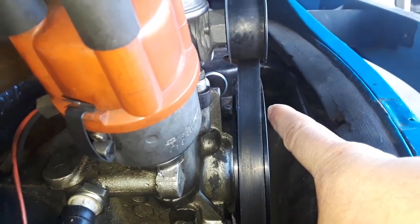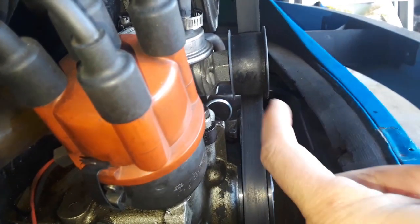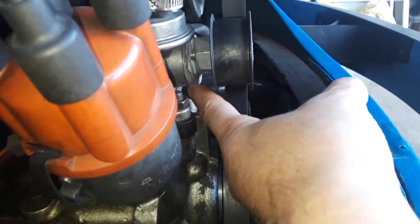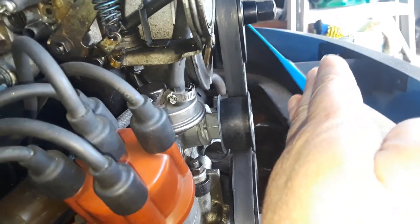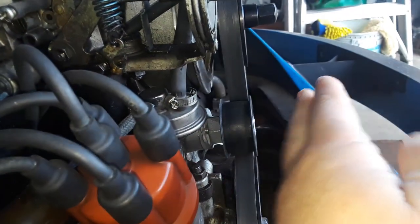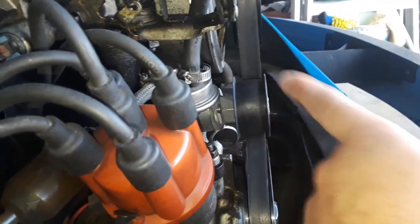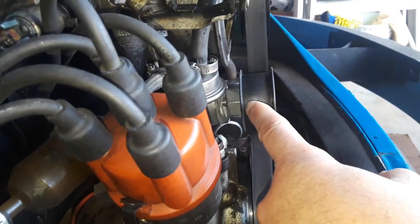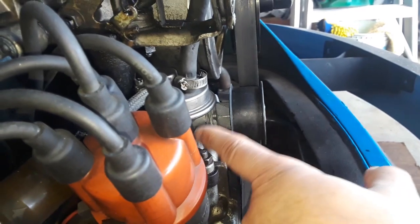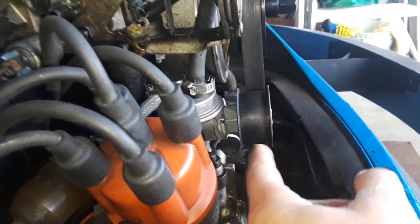You can see how it thickens and thins out - it's going that way. It used to actually be going the other way, but I introduced a little shim right here - just a razor blade - which made the pulley go from being sideways to slightly over in that direction. When it was like this, the plastic would pull that way, and the belt caused the bearing to disassemble itself. It pulled away from the bearing inside the plastic.